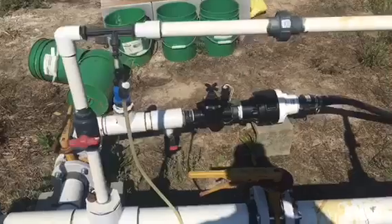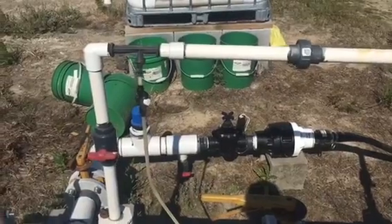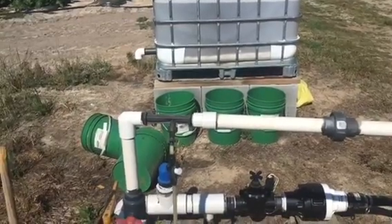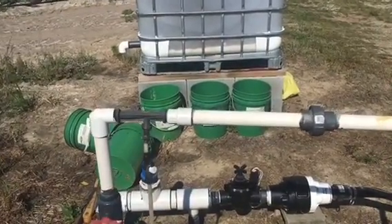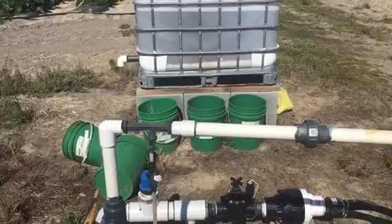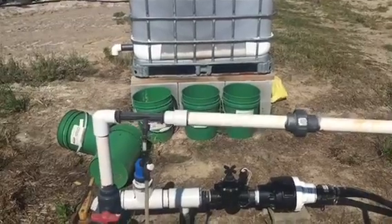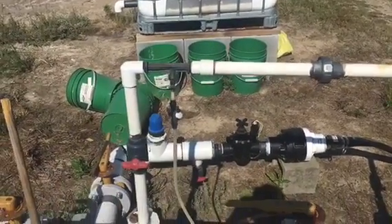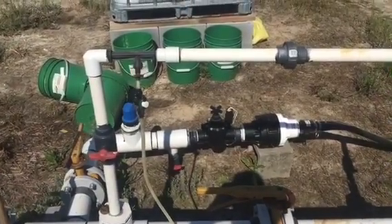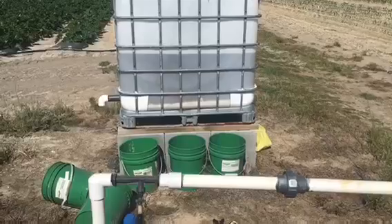It takes about 45 to 50 minutes to inject all the fertilizer into the line, then we irrigate for about two hours. This venturi will be replaced this year — probably when Walter goes on vacation I'm going to install the Dosmatic and he's going to have to learn to live with it. This is 9-0-6 fertilizer; we don't really want to give specific recommendations because it's all based on your location, but this stuff gets about 20 gallons of it three times a week. We fertilize on Monday, Wednesday, and Friday — we spoon-feed it. Boron, for example, gets a quart and a half per acre divided into three applications.